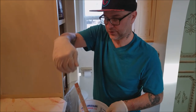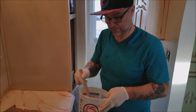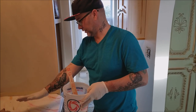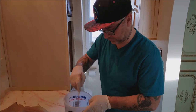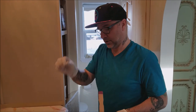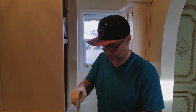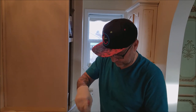it'll look like you're pulling the resin out, but it'll just come right back and settle in, because it's not all the way settled. So it'll let it settle back into the wall or into the sink, and it'll just be really nice and smooth. So if you leave the tape on there, you're gonna have to cut it, and there's always edges and tape sticks, and the resin sticks to the tape, and it just looks trashy. It just looks terrible. So you'll have a mess if you let that tape sit.